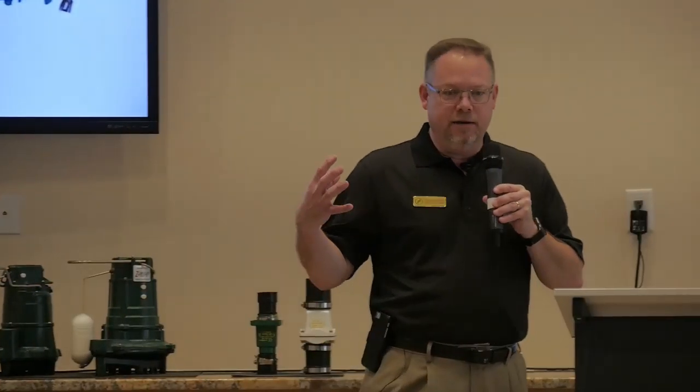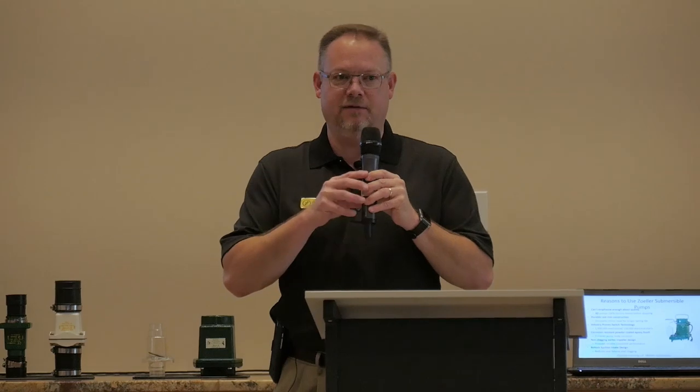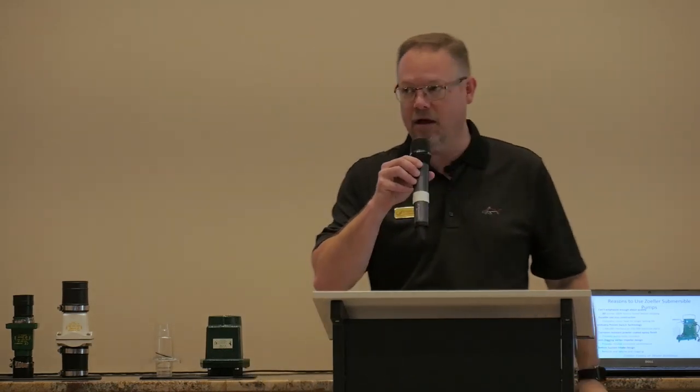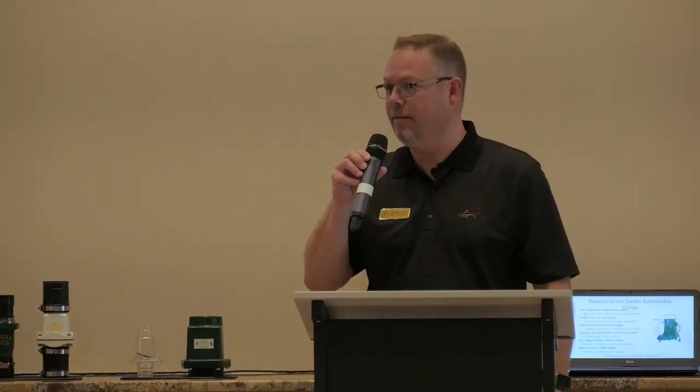The way they operate basically is when they start to spin and the fluid is drawn into the bottom of the pump, it's pushing that fluid to the inside of that pump volute. And the vortex impeller really doesn't come in contact with the fluid much at that point. It's basically like that ride at the fair that you used to get on.